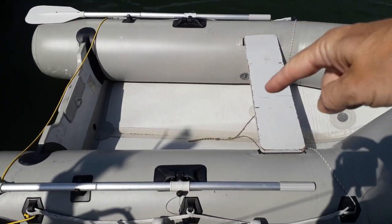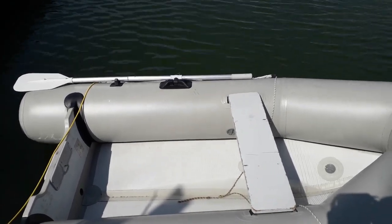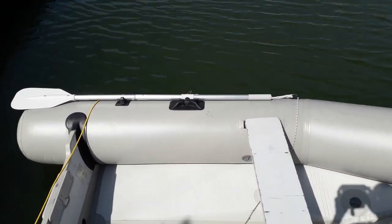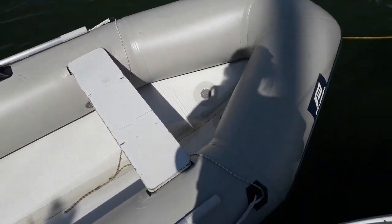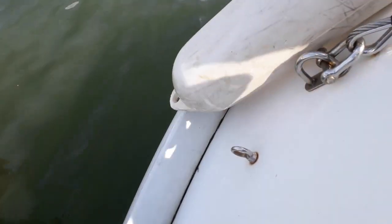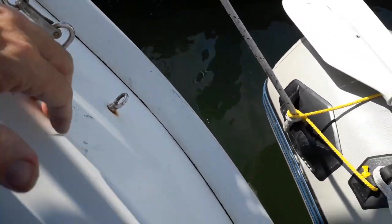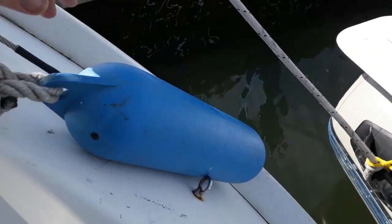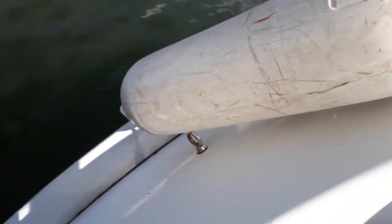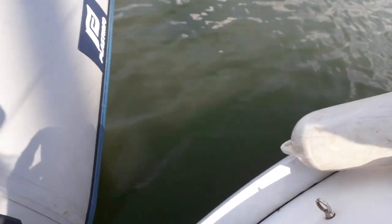Normally when we mount her, things like the seat and the oars would be taken off before we lift the dinghy up. She's sitting currently just behind our swim platform. What we do is we have a bridle which we attach to this little point here, which goes through to the transom — there is another one on the other side. We have some dinghy fenders which we put between the backstay and the fitting, and what that does is when the dinghy is mounted up here it stops the dinghy rubbing on the backstay, which would maybe puncture it.